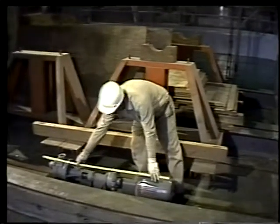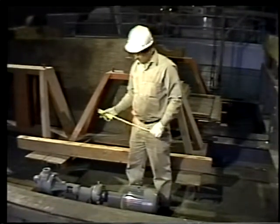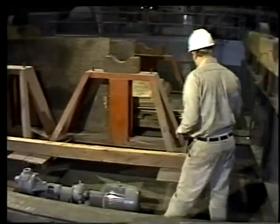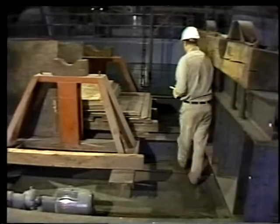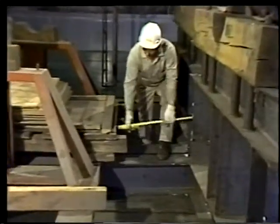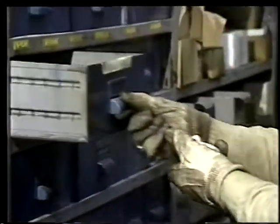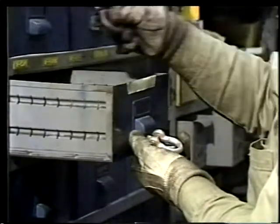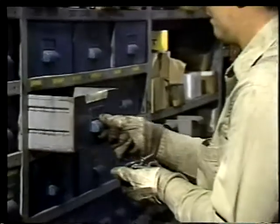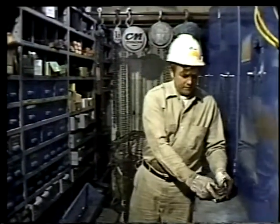We've seen how weight and balance affect the planning of a rigging job. Another important factor is clearances. Careful measuring is the only way to be sure that the load will fit through tight places along your planned route. You have to measure the load and its path to determine the clearances you'll have to work with. Last of all, you have to select the equipment, bearing in mind that any piece could be the weak link that might cause a serious accident. If any one piece can't support its part of the load, the whole thing comes down.